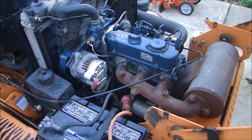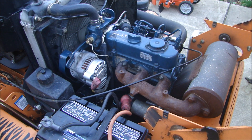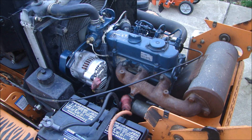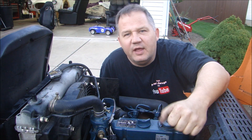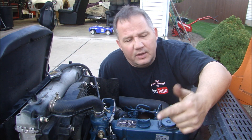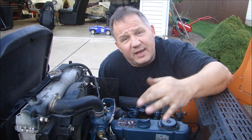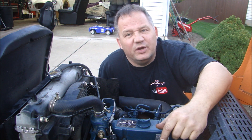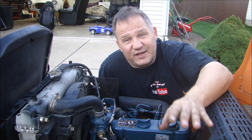Got her all back together — let's start it up and see how it goes. Alright, there you go. I just took it for a drive — threw it really hard for 15 minutes, full throttle, blades engaged, under load. Runs perfect. So if you've got a Kubota D902 and you're having problems with it bogging down and blowing smoke, the first thing you can do is check the injector pump. If you do take the head off, keep the push rods in the same order so you can put them back in the same spot and not have to redo the valve lash — I checked the lash anyway, just didn't show it. So first thing you want to do is check the injector pump, and if that's your problem, you're all set — you won't have to tear it all down.